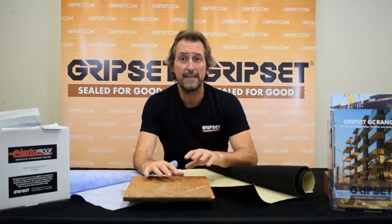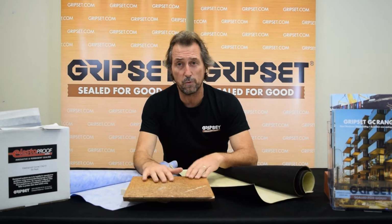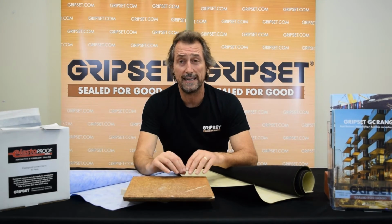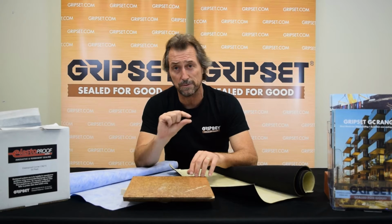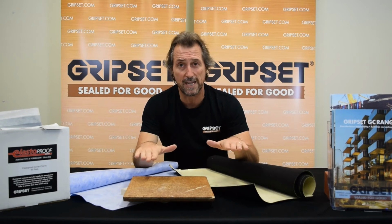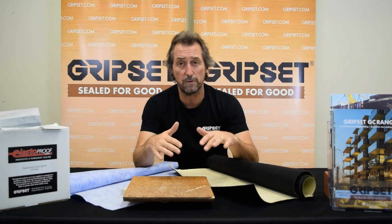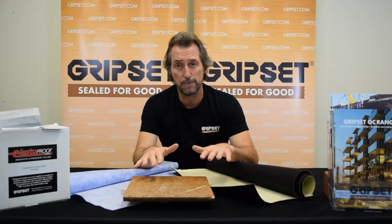Now, there are options in that situation. I've seen many tilers and waterproofers, when they're faced with that situation, they will perhaps nail cement sheeting down, the thin HardieFlex, or the equivalent of that, 4 to 5, 6 mil thick over the top. It's a more stable surface which works like an underlay, and then they can put their waterproofing or tiling directly over that. Very important.